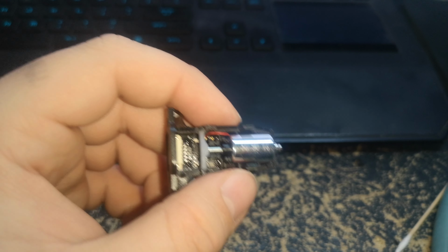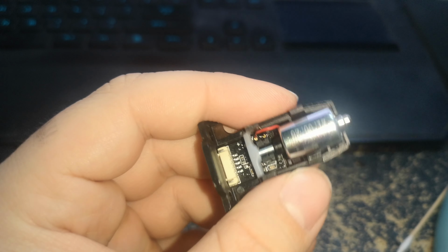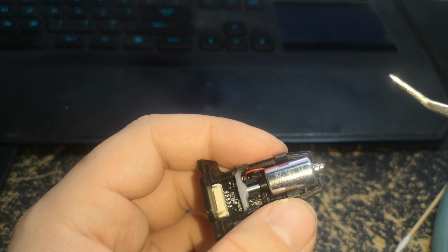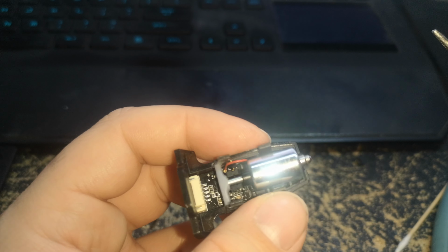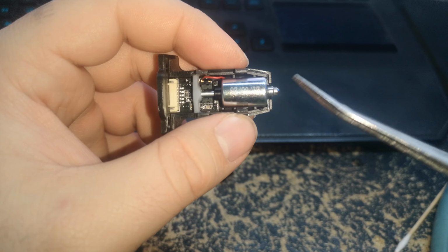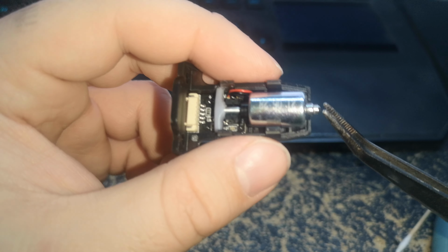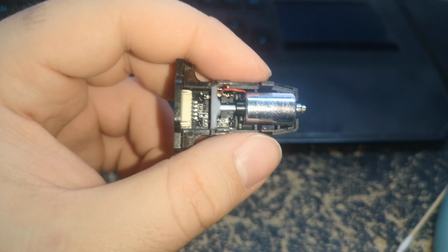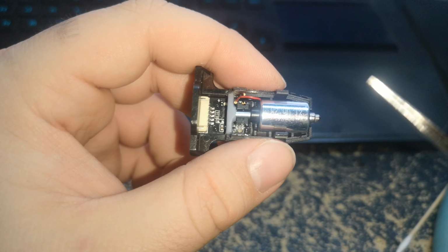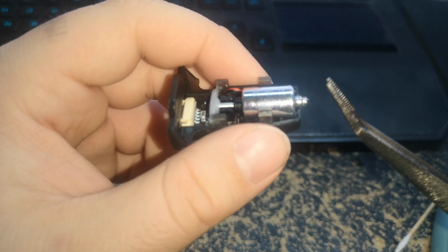How about a plastic pin with a magnet in it? Like, yeah, okay, you don't have a metal pin. Big whoop. If your bed's 150C, then sure, the injection molded plastic one on the BL Touch might be an issue. But this thing making a shitload of noise is also a pretty big issue, and I think more people are going to have this on beds that don't reach that kind of temperature. And that would still be able to work, although it would need like a chunkier pin and solenoid design. But they've got the room in this thing, it's bigger than a BL Touch. Like, that would fix the issue as well.